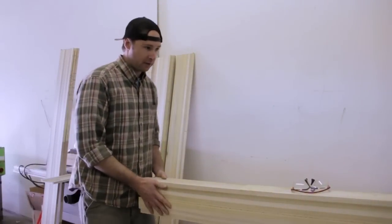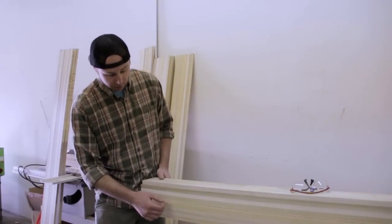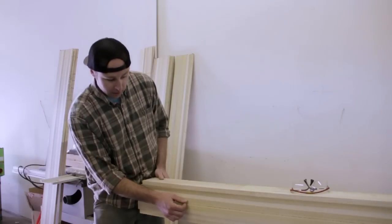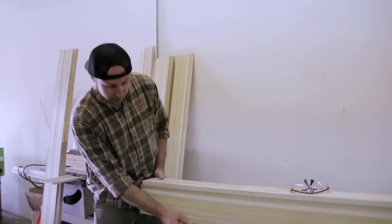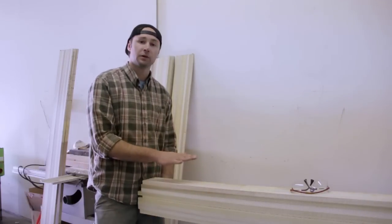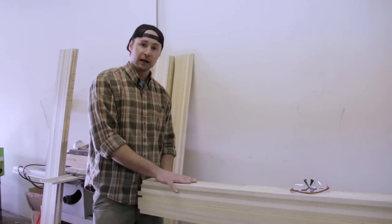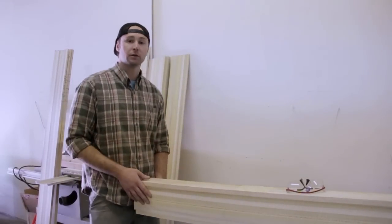So this is the material we use to manufacture our wood cores. We vertically laminate poplar and bamboo. We've got four laminates of 3/4 inch poplar, one laminate of 1/2 inch bamboo, and four more layers of 3/4 inch poplar. We'll take this big block, which we manufacture in house here, and vertically trim them off with our big industrial bandsaw.